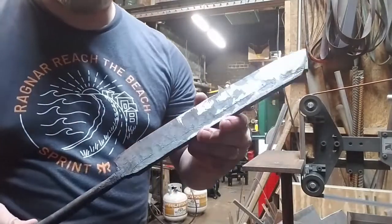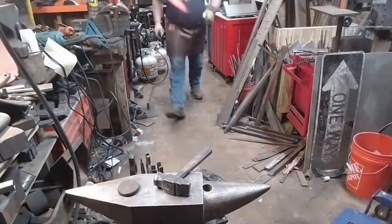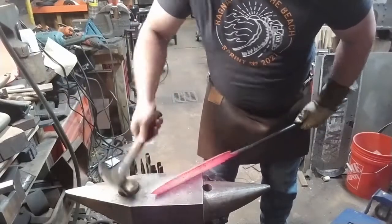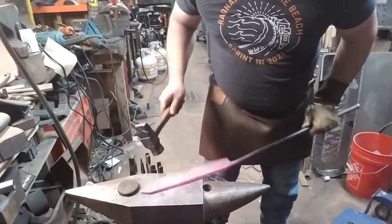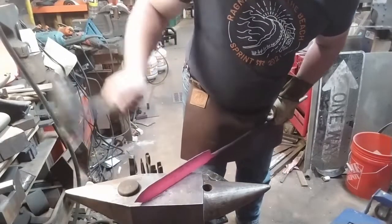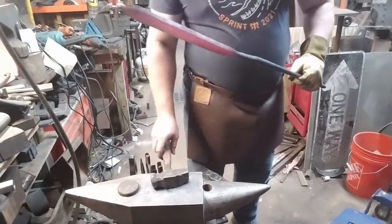Here we're rolling over the end of the knife and turning the bottom of the knife into the center of the knife. And that way the pattern on the blade will flow much more fluidly. We do see that in Norse construction Seaxes, in drop point knives, drop point and clip point Seaxes. We see that. Not so much on Anglo-Saxon blades.